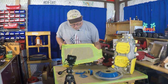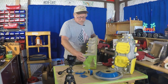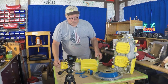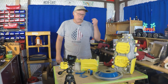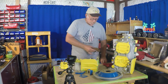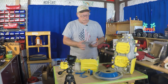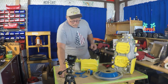On this crankcase, the entire inside has been masked. The back has been masked. There are areas where your engine mounts go, but also areas where Lycoming typically puts grounding holes — machine holes. A lot of OEMs or home builders will use those for your ground cable, so you want to mask those off to make sure you have a very good ground. We had an aircraft two years ago where starter problems and charging problems turned out to be grounding issues, not electrical issues. One way to mask gasketed surfaces is to cut out gasket shapes from tape on a smooth surface with a razor blade, then apply that to the back of the engine.